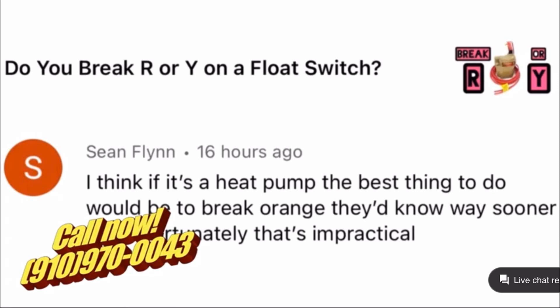It's funny because it's like a joke. If you broke orange on a heat pump — and he's referring to cooling reversing valve heat pumps — whenever you're in cooling mode the reversing valve is energized. So essentially he's telling people to break the orange, which will switch the reversing valve into heating mode while the unit is running. So if you have a drain pan that's full and it trips the float switch, it's not going to shut off the AC — it's going to switch it into heat. It'll pretty much run constantly.